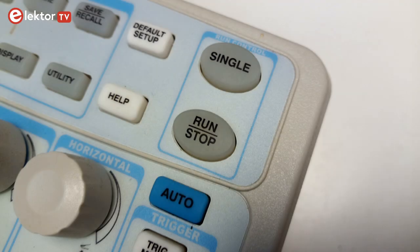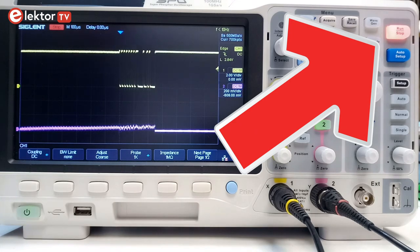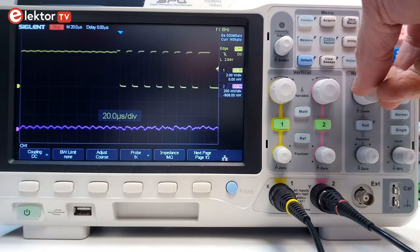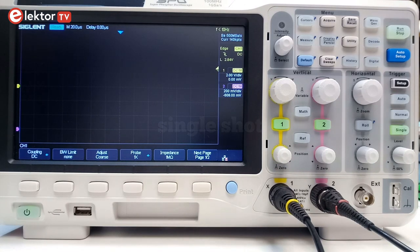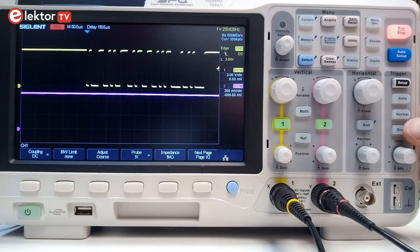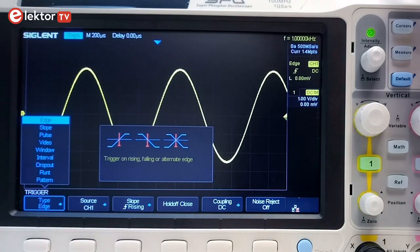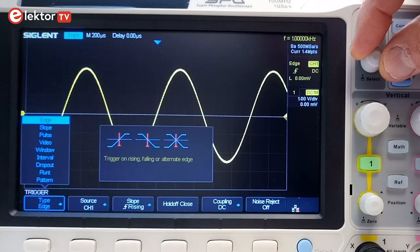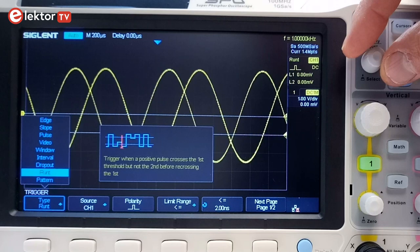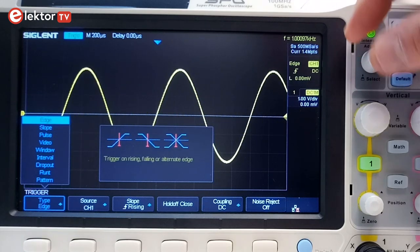It is quite probable that your oscilloscope has a run/stop button and a single button. The run/stop button lets you freeze the display, which is handy if you want to study a signal in detail without allowing a new trigger to change it or make it disappear. Press the button again to leave this mode. The single button can be used when an event happens only occasionally, for instance only at power on, after pressing a button, or when it's not periodic. After the trigger happens, the trace will run only once and then the oscilloscope enters stop mode. Depending on the oscilloscope, there can be more trigger options, going from triggering on both slopes or on a time delay between slopes — the pulses so to speak — or triggering on a sequence inside or outside a window with delays. As I said before, the more trigger options, the better.